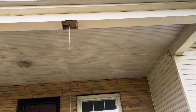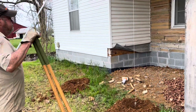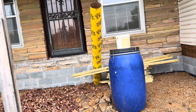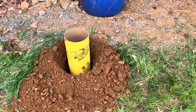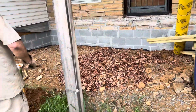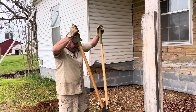It's just going to come out to where their awning or cover comes out. We've dug four holes and we're putting these Quikrete tubes — these are eight inch round tubes, four foot high. They're going to go down in each hole just like what he's got here. Then we're going to fill them with concrete, and they're going to set up for a little bit. That's going to be what the supports and the braces are for the porch.